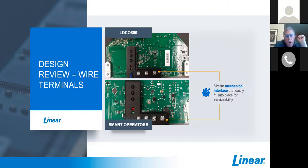The Smart operator, the bottom picture, you'll see 4 terminals. And on those, the first 2 are for the wall station. Those are polarity sensitive. Most important, when you hook up the unit, you hook up the photo eyes and the wall station. Then you apply power to the battery. You make sure this blue light is lit. And I'm going to do a quick turnaround. You can see the blue light perhaps on this unit.